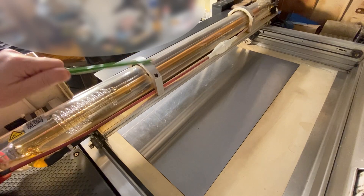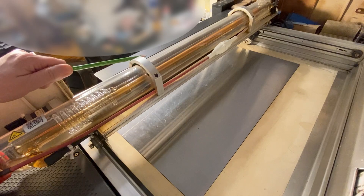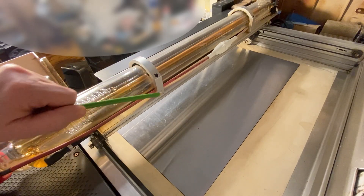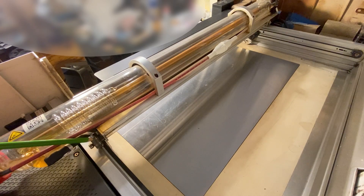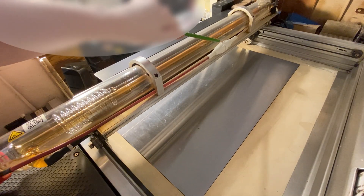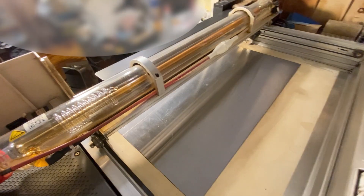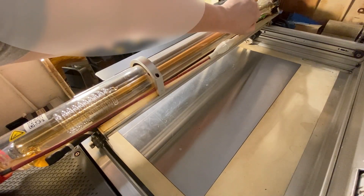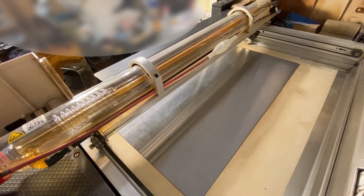We are using what I'm calling the aluminum hoops — these pieces covering the glass laser tube — for cable management, to make sure that our cable stays nice and neat and up away from these roller wheels, because you do not want your red wire to come in contact with these gantry wheels. You can see our connector in the middle and our gantry wheel down here. Our red wire is nice and away from this wheel. We have run it up through the factory hole in this aluminum piece.